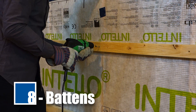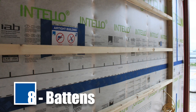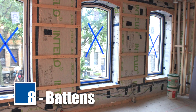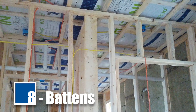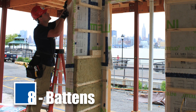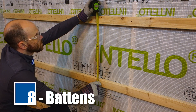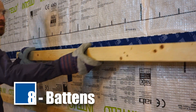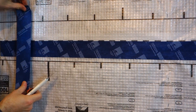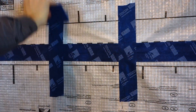We highly recommend the use of battens to ensure long-term airtightness of the assembly. Battens create a gap between the sacrificial layer of drywall and the air barrier, create a space to run utilities, and assist in holding up the weight of blow-in insulation. Additional insulation can be set in this cavity before sheetrock is installed. Horizontal counter battens can be spaced at a maximum of 20 inches apart before insulation is blown in. Tape joints should be supported with a batten over the tape or reinforced with perpendicular strips of tape spaced less than 12 inches apart, also known as stitch taping.